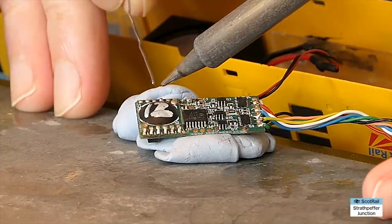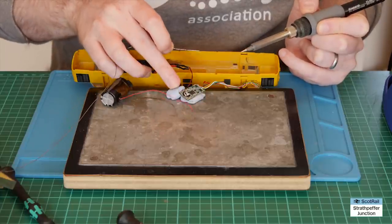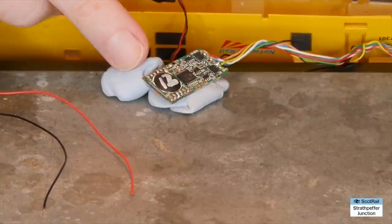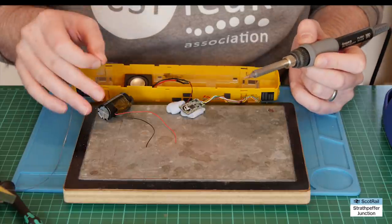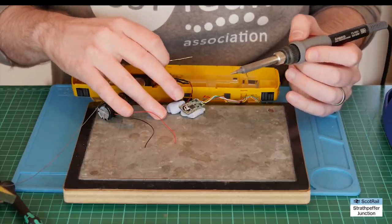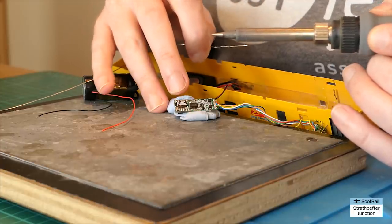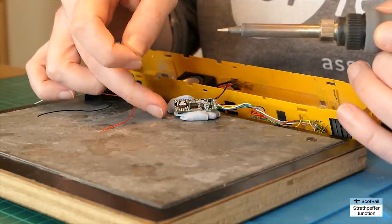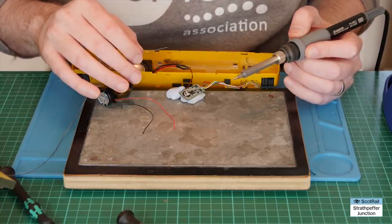There we go — all I've done is pop a tiny additional bit of solder on top of that pad so we'll be able to solder the wire on. Do make sure when you do this that you don't get too much additional solder on — we're talking really small amounts. If you flow too much extra solder onto that you might end up flowing it underneath the chip or onto other joints and it'll get really messy and become a much bigger job.